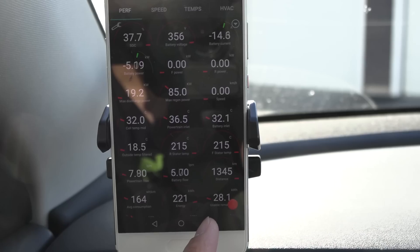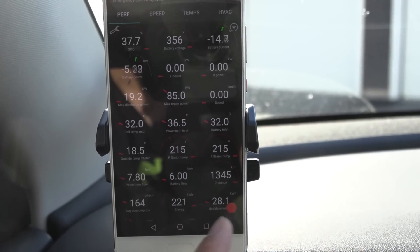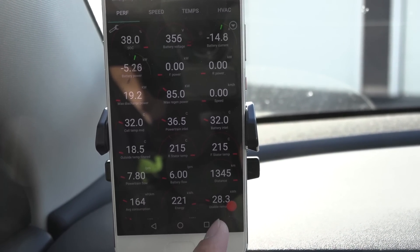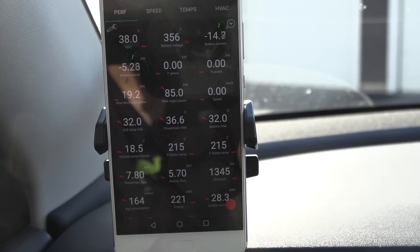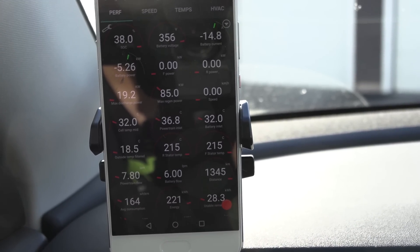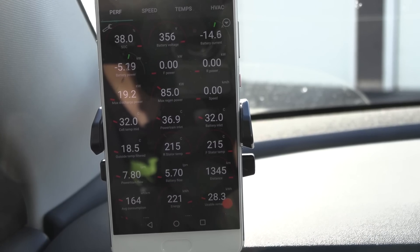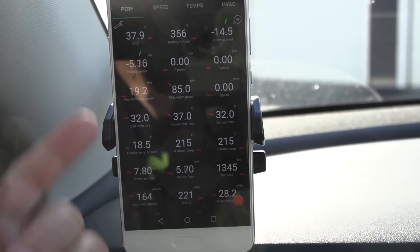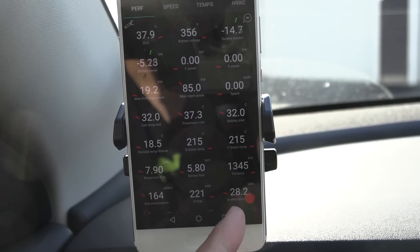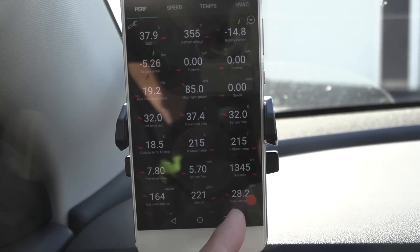Ideally I need to start low, because if I'm low then I will see higher precision on the number — now it's just 0.1 kilowatt hour resolution, which is kind of low precision since the battery pack we're getting from is only two kilowatt hour, but close enough. I'm charging it up a little bit now — maybe just to a round number.